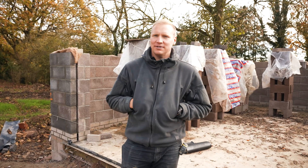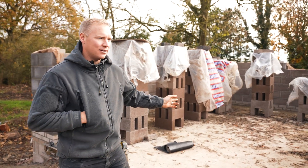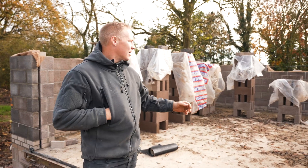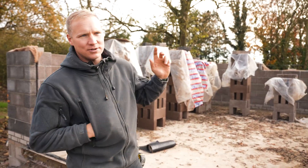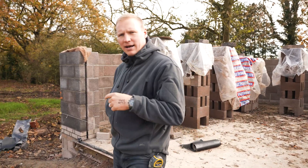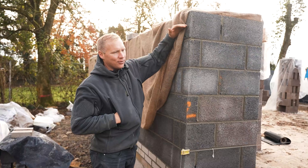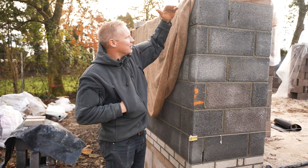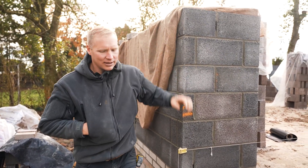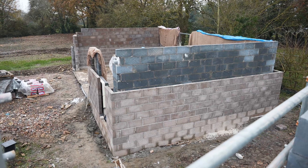The other day we spoke to you and we'd just started the garage. I think we'd got a couple of courses of bricks around and we'd got up to a tray or something. So since then we've been on it this week. We've got all the inside up to six courses around, and then we've backed it up as well. Because the ground's so wonky here, we're going to get a scaffold about here. Normally you'd want a scaffold a bit higher but we can't really reach any further because the ground's down, so we're going to get quite a low scaffold. But it just makes our life easier than trying to struggle and get some more height on it.